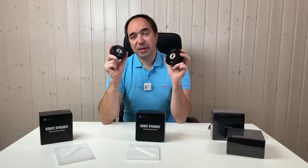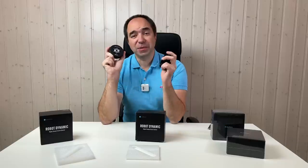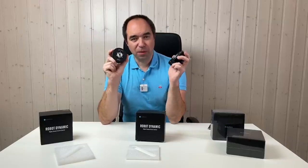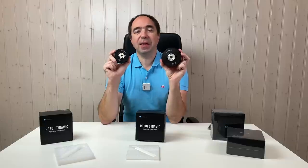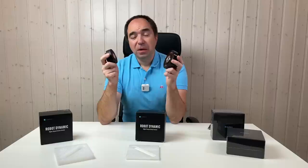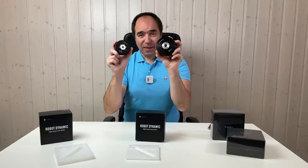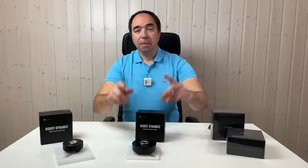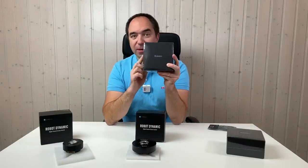One of these things is the cross-roller bearing at the output. And another thing, the possibility to measure the temperature of the motor. Because usually in quasi-direct drive actuators, the motor can get quite hot, so it's nice to have the possibility to check this temperature. I understand that a cross-roller bearing is quite expensive, probably that's why they have not used it over here. But the T-Motor company was kind enough to send me a new actuator, this one.